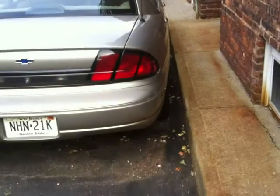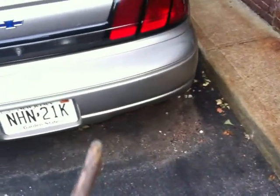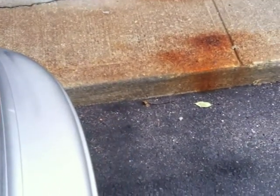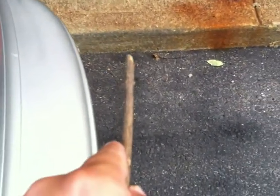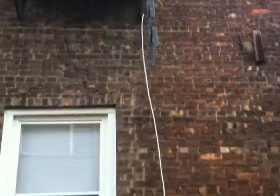And sometimes, during snow emergencies or whatever it may be, people don't always park properly. So what you're going to want to do is put in a bollard or some form of marking here on the ground, very clearly identifying that there be no parking behind us. A lot of times a bollard is what you want to use here, but because of snow and plows you may have a problem. But definitely a huge yellow streak will keep a car from ever parking in an area where the ladder comes down and falls down.